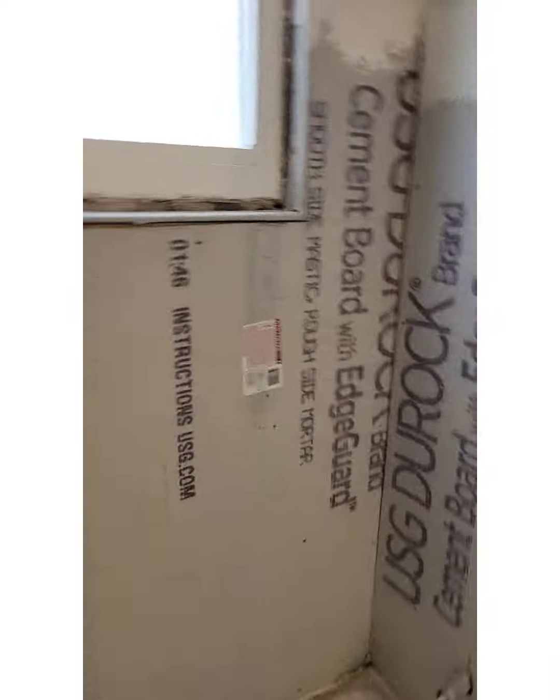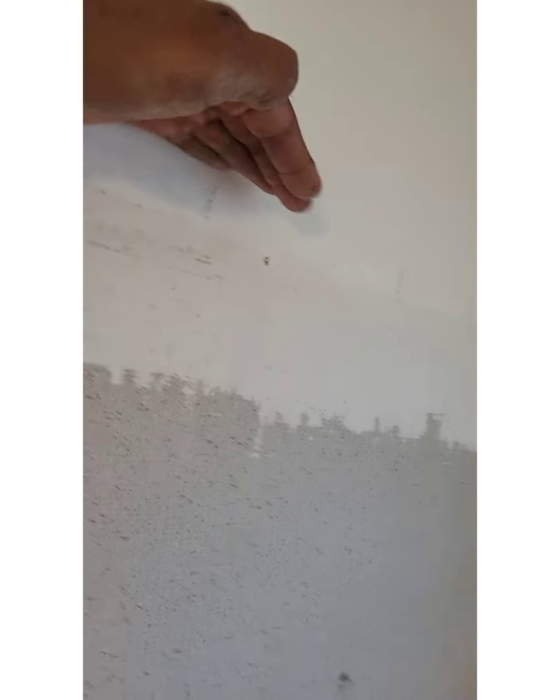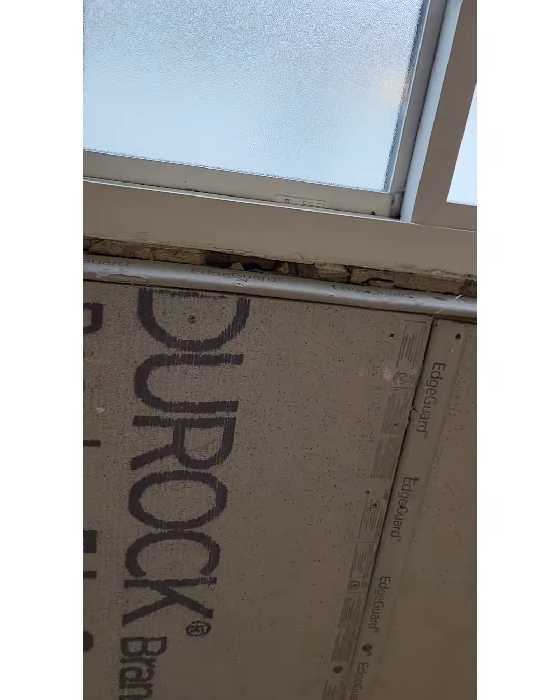Kevin Williams, manager of All Skill Construction LLC, getting ready to do a tile job around the tub area. So I already put my board up and my tops. I usually just mud right there with a drywall mesh and a board stop, and then my tile will go higher. You've got to put tape and thin set in all your joints so that it won't crack. So I do that as I go along.